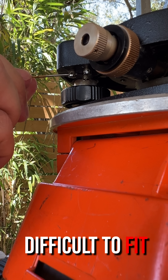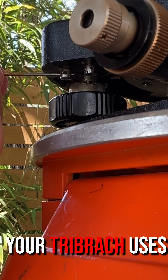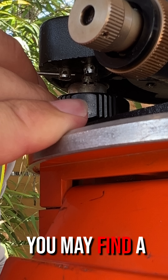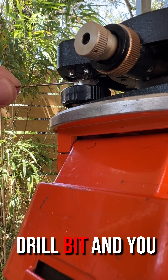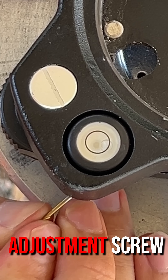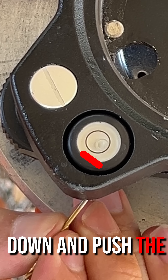It can be difficult to fit an allen key or screwdriver under the bubble vial. If your tri-brac uses adjustment screws with holes in the head, you may find a tool with your total station designed to fit in those holes. If that's missing, you can use the shank of a small drill bit, and you may have to grind it down further to fit.